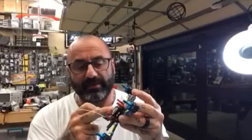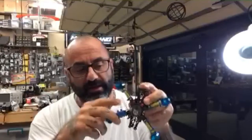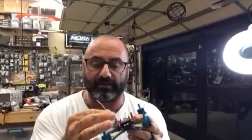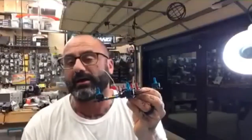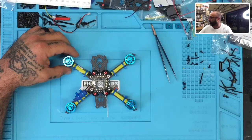And then the next video, which we just finished, was preparing for the FC, which included adding the capacitor here, and then running also the ESC data wire, the telemetry wire from the ESC, which attached to the underside of the flight controller in the RX6 or UART6 receiving end. We then soldered in the UART6 TX or transmission side, a wire which will then go to the smart audio on the video controller, right? So let me go ahead and do a split screen here, and now you can see what we're working with.